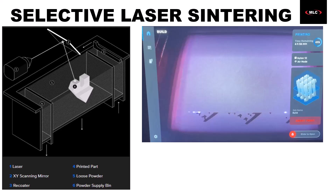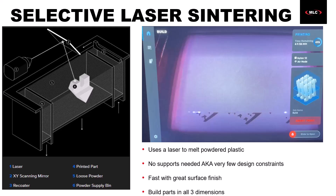The main thing that means is you don't have to worry about overhangs anymore, which opens up a huge amount of possibilities for super intricate and complex geometries. All kinds of lattice structures all of a sudden become printable. Parts have a super good surface finish everywhere because there are no supports, they're also bonded very strongly between layers — even more so than FDM — and the process is incredibly accurate.